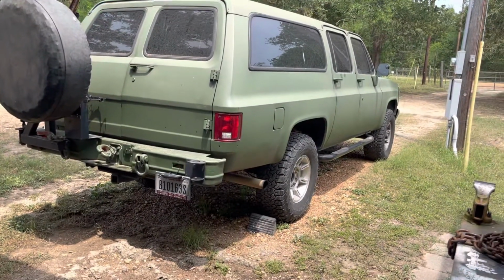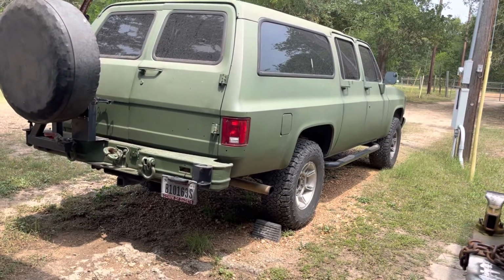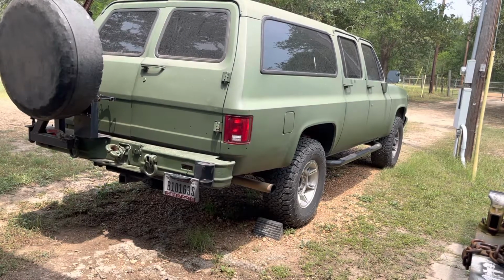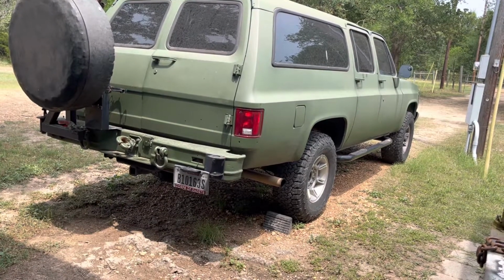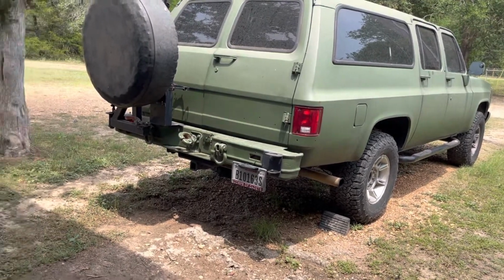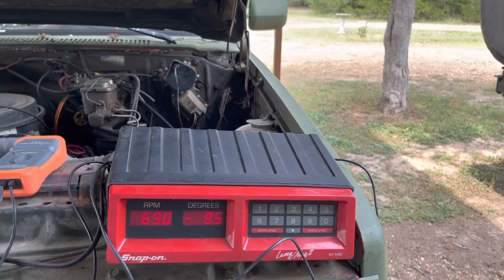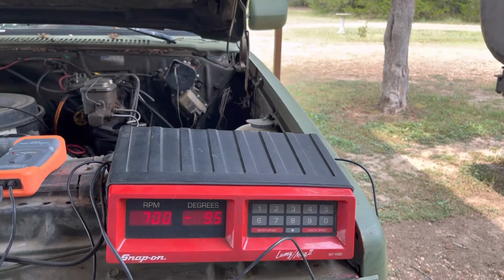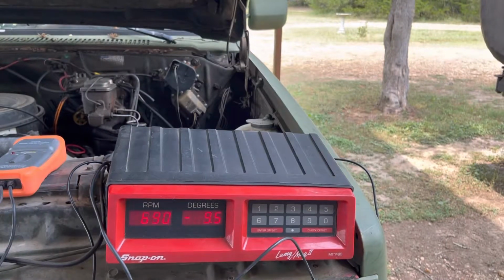My cowdog truck with a 6.5 turbo, Optimizer GEP 6.5 turbo, the Banks turbo, it's set at 8 degrees positive at idle and about 3 positive at 1300 RPM. That's the happy spot for that engine. This engine, the happy spot is negative 9.5 at idle. Why? I don't know. But you see this one showing negative 9.5. The timing light was right on zero. So the two different methods give you two totally different timings.